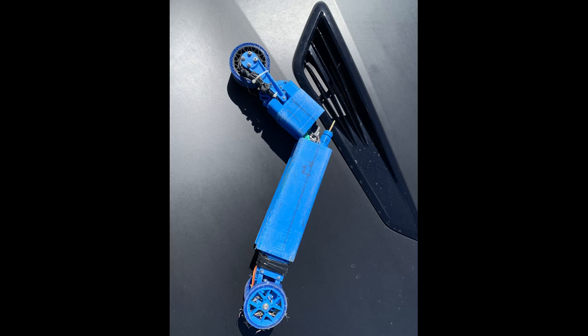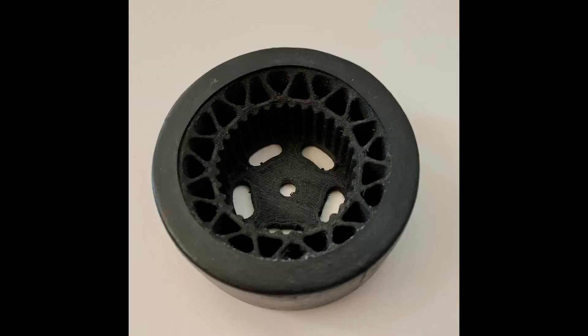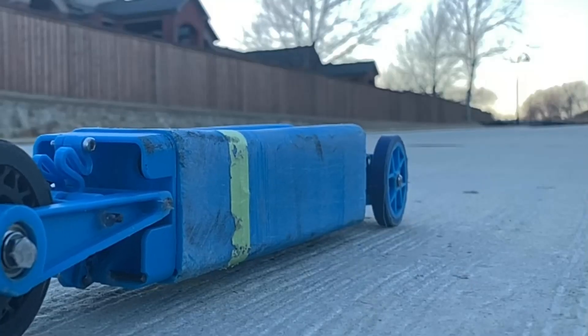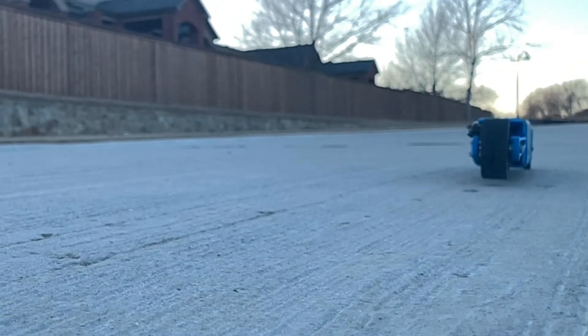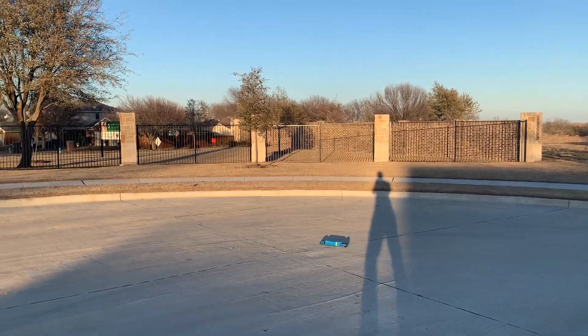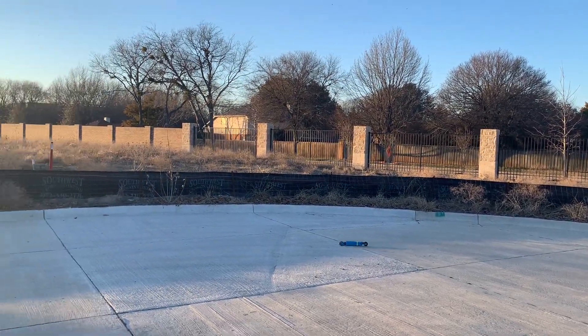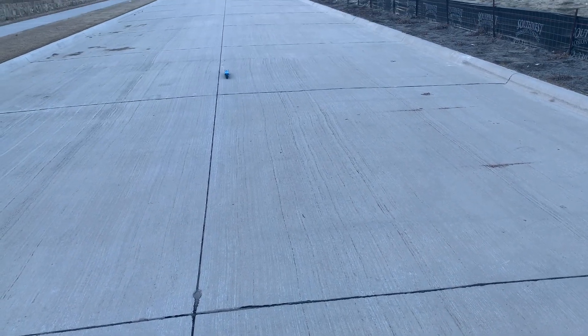After a trip home to repair the car with super glue, I had one final test: the rear tire. I decided to try bicycle inner tube, which is around 40 durometer rubber. I stretched it over my existing wheel with the TPU tire and glued all the way around — it came out looking really trick, almost like a real tire. This ended up being the single biggest improvement for the car, especially in launching. I can roll on the throttle much quicker and actually steer the car while under power without drastic oversteer, which completely changed the game and allowed me to pick up speed much faster.